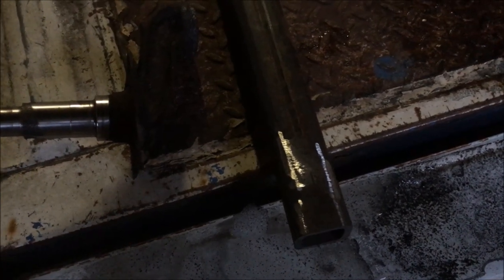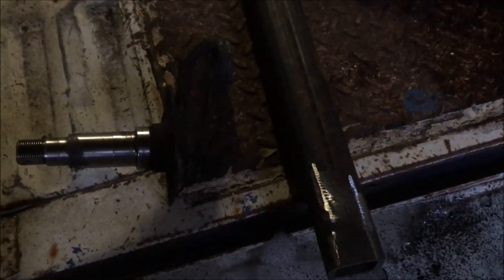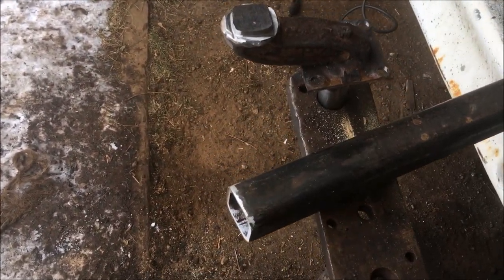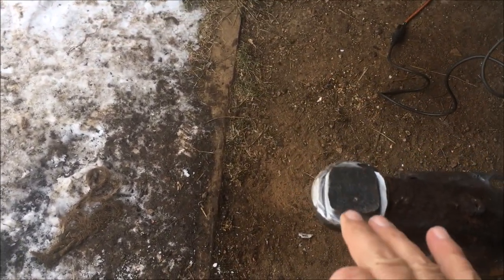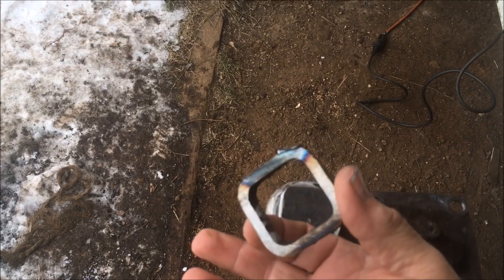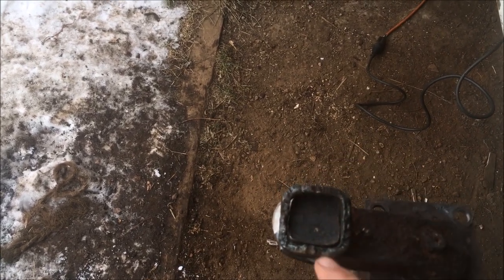So that's what I need to do — grind those off and make a jig to weld them on there. I've been working on my trailer axle and I'm just about ready to weld it back together. I've got the ends of the spindles ground to match the square tubing. I used this little scrap piece from the end as a guide to fit that there.